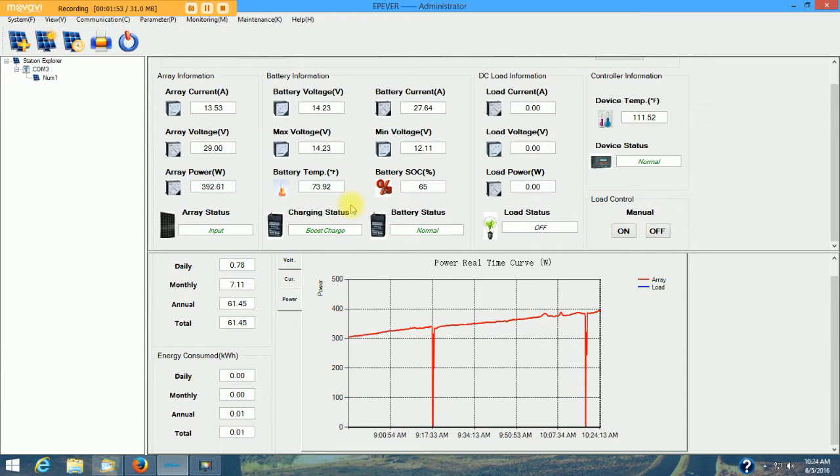At the peak of the day I can probably get about 450 watts. The gauge showed a watts peak of 561 — that was with the Harbor Freights included — but realistically I think I get about 90 watts out of those. So I think at peak I get pretty close to 500 watts from my 600 watts of EcoWorthy panels, which is really good. They're only two months old, and though that will drop over the years, they do have a guarantee and I'm really happy with them.